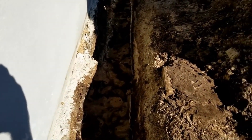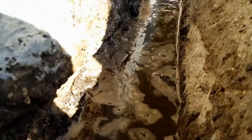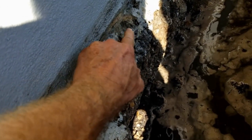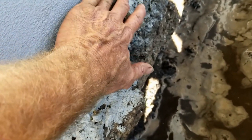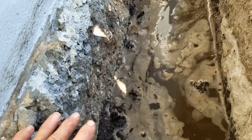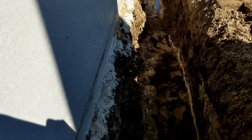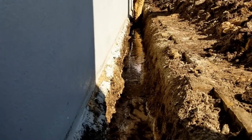We've got it really nice and clean, looking good. We are in a sandy base and you can see all the water laying down in there — that tells me groundwater is really high. You can see what they've done here: they painted the stucco and it is a good paint, but it's a sticky, sticky stuff. We've got to get this sealed right here, right where the stucco meets this footer. This is solid concrete — not concerned about sealing that at all. There's no water getting up through there, but it is getting sucked up right along here, which was below grade. You can see where the grade line was. For a permeable sand, you can see it's drying up quick, but that water table is pretty high.